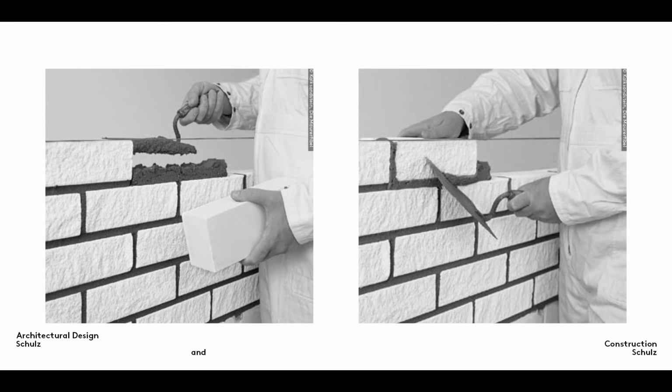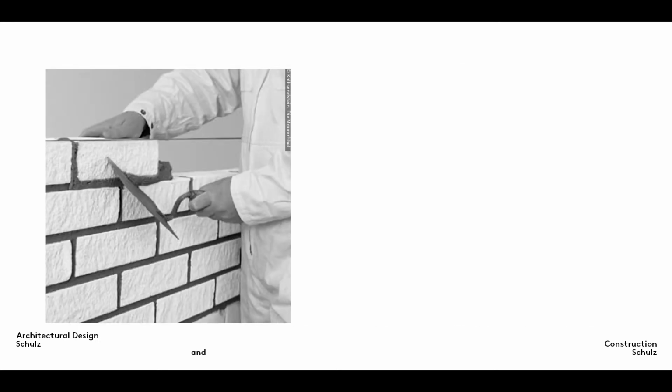The glue used to hold them together is known as mortar, a sort of damp paste that sets in a chemical reaction and thus binds the bricks together. The layer between two bricks or blocks is called a mortar joint. The horizontal joint between two superposed bricks is called a bed joint. The vertical joint between two abutting bricks is known as a butt joint.